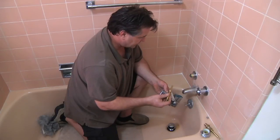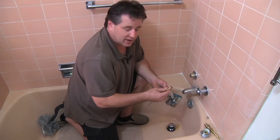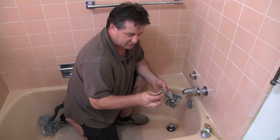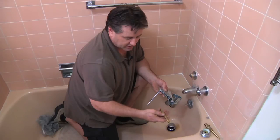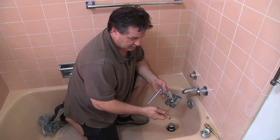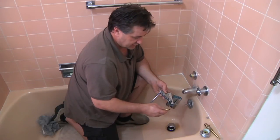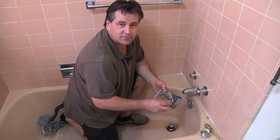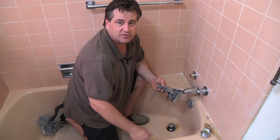There's really not much to it. You just find the right valve, replace it, fix it — whichever you need to do. A lot of times it's easier just to replace the whole thing, because once these start to go, they're also probably corroding and looking bad — it's better just to replace them all. If one is bad, the other one is probably just behind it. Turn off the water, find the right valve stem, find the right wrench, and you can do it — save yourself some bucks.